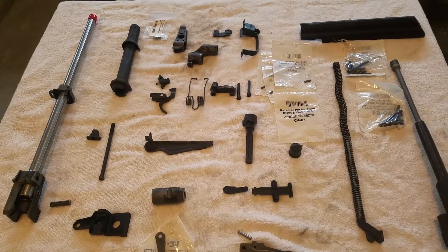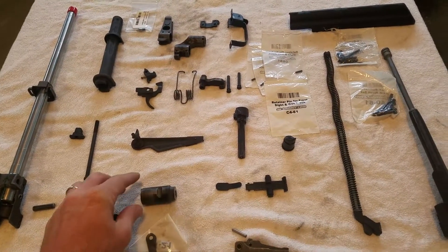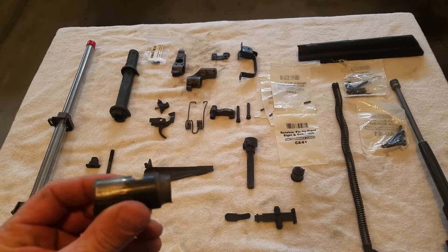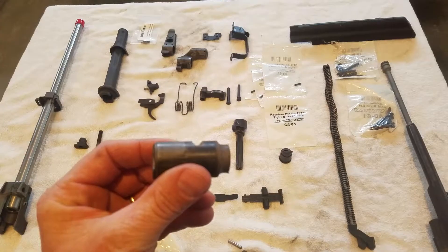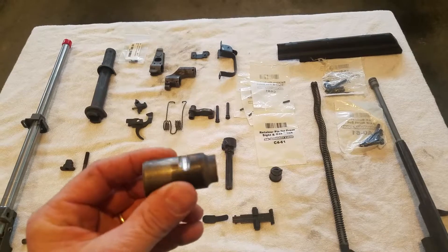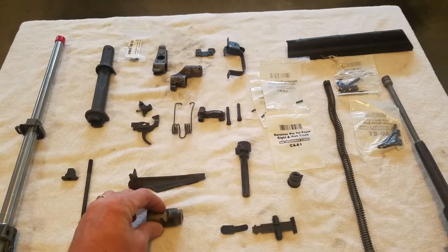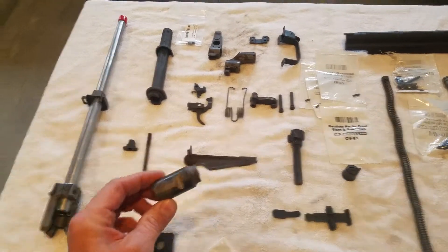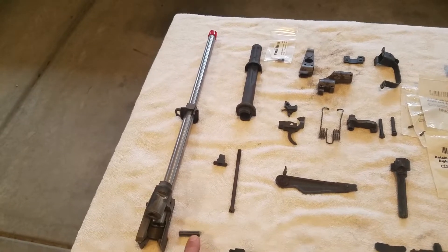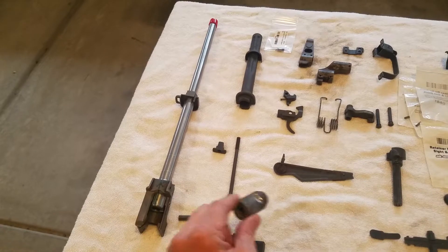Here's the old barrel. Now if you don't have a press to get these out, you're gonna have some bad luck. Luckily my buddy has a press, so I went and borrowed it and just popped that thing right out — relatively easy. That's what you'll see on a de-milled kit — the barrel would already be in the front trunnion right here. This is where your pin sits; the barrel pin is right there. I pressed it right out with no problems.